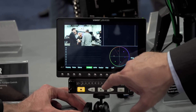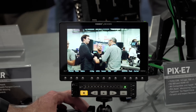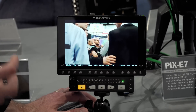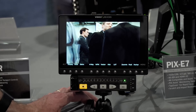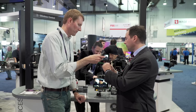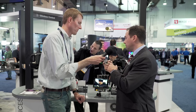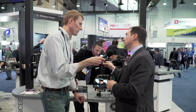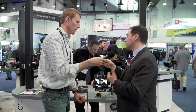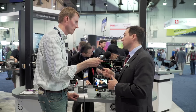As a monitor, it's a very powerful, very high-accuracy screen that has the capability to record ProRes. At NAB this year we've introduced H.264 recording in addition to ProRes. You can record onto the Speed Drive, which is the primary storage medium. This is an mSATA SSD inside, and when it connects to the device it connects over SATA. When you remove it and connect it to a macOS or Windows machine, those files are available over USB 3, so it becomes a mass storage device at USB 3 speeds.